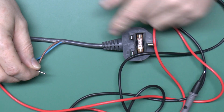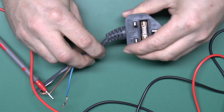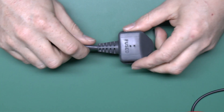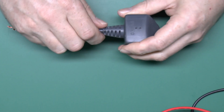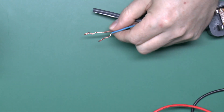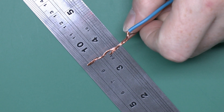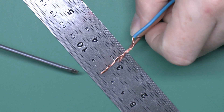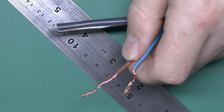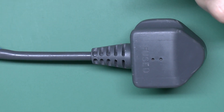So clearly it's broken, and I think it's somewhere in here. When I had this plugged in on the actual vacuum, if you sort of bent this around it would actually sort of work for a minute, and then if you moved it slightly it would obviously fail. It's a fairly common problem with vacuum cleaners in that this obviously gets bent around a lot. I'm quite surprised that it has broken, as this wire is not exactly what we call thin — it's quite a substantial size. I mean these are millimetres on the top here, and it's quite a reasonable thickness of wire, so not the sort of stuff you'd expect to fall to pieces after only 18 months, which is how old this thing is.